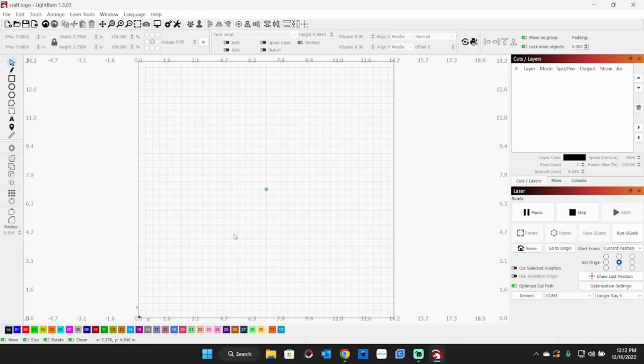For our first one I'm going to be doing this in LightBurn, and we're going to be working on this particular laser from what I call current position with job origin in the center. This laser does not have limit switches, therefore there's no homing function, and this is easier than attempting to use absolute coordinates on this. So if you're just starting out, it's a very simple way to get started — just get your laser centered on your project, that will be your current position, and I always work my job origin from center.